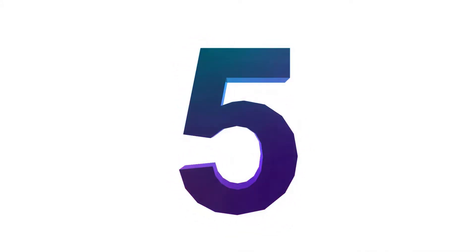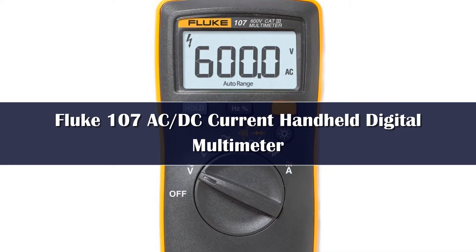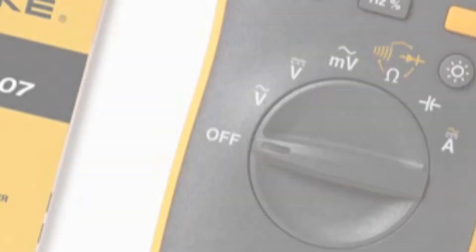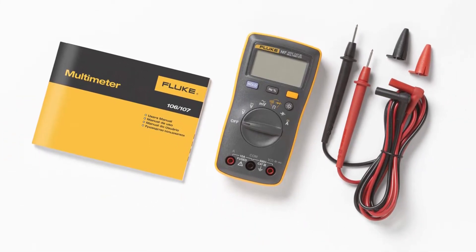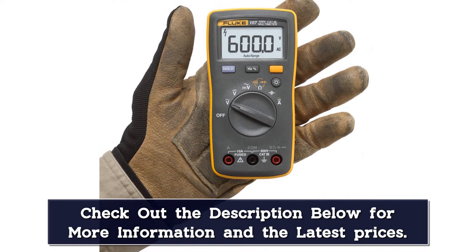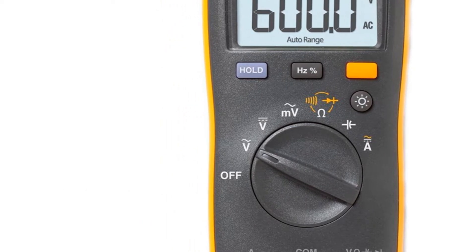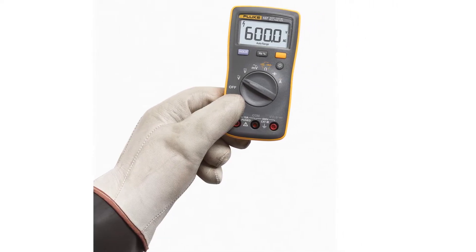Number five: anyone looking for a multimeter that will serve most of their purposes without being overly complicated should check out the Fluke 107 handheld digital multimeter. It has a simple design with functions for testing voltage, amperage, resistance, capacitance, and even frequency. It comes with a basic set of test leads as well as a magnetic strap that can hang from an electrical box or pipe hands-free. It easily tests voltage, amperage, and resistance, and has a separate switch for continuity. We like that it has a backlight and large screen, and the magnetic strap can double as a stand. Our main complaint is that it doesn't come with a carrying case and there are no storage clips in the back for the leads, so storage could be an issue.